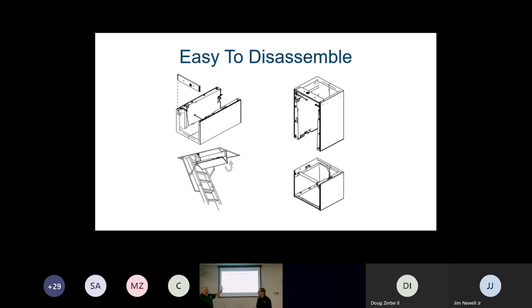Correct. So it makes it really modular, honestly, as far as being able to break it down and put it up in an attic. Guys who do this all the time can do it in under 20 minutes: tear it apart, put it up in the attic, put it back together. So it's really handy to use this unit up in an attic space where you've got tight access. And I know there are some older guys sitting out there. If you remember the days of a TWE, like an 030, I used to stay in a driveway, and it was over an hour and a half to take the coil out, take the brackets out, try to pull the metal cabinet in to create a V, get it up, and then reassemble it totally in an attic. You know what I mean? Now it's a piece of cake. An hour and a half compared to 20 minutes.